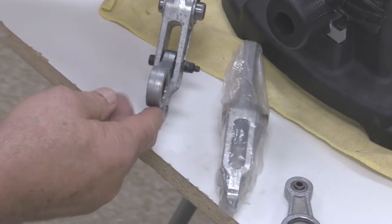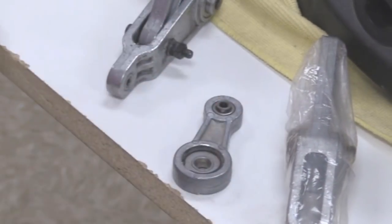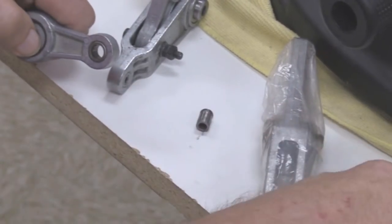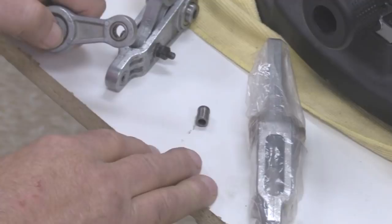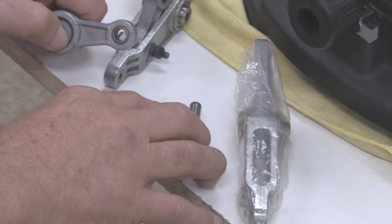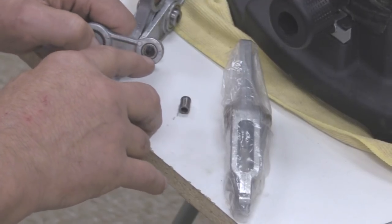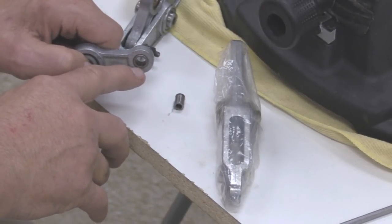The connecting rod that I told you about is this piece here. Here's one that's out of the machine, and its sleeve looks like that. And usually what I do when I take a machine apart to examine it, I clean that sleeve off, because this is one of the most critical ones in the entire machine. Clean that thing off and examine it just real carefully to see if there's any marks on it that would mate up with the size of the roller bearings that are inside the small end of this connecting rod.